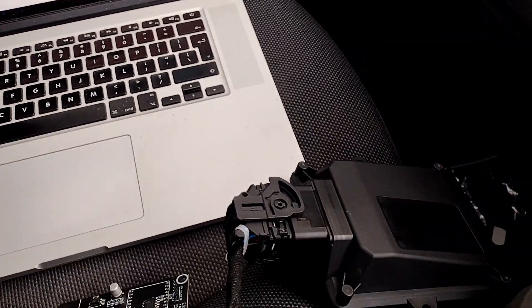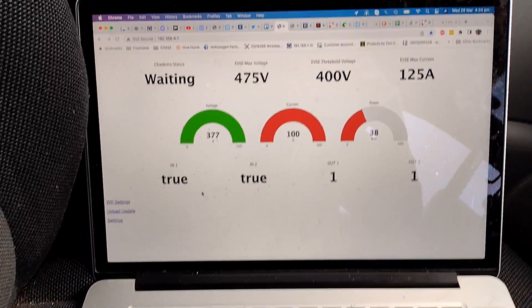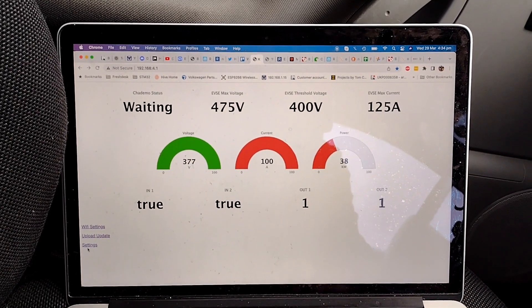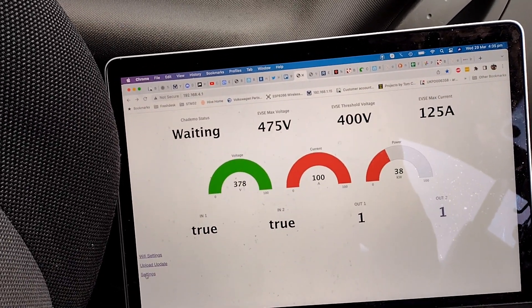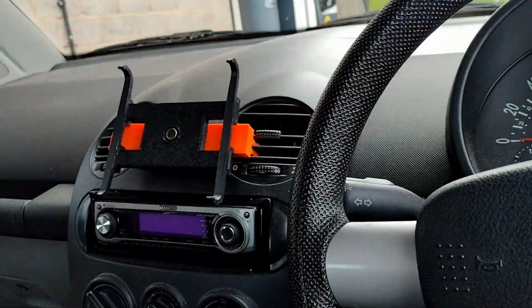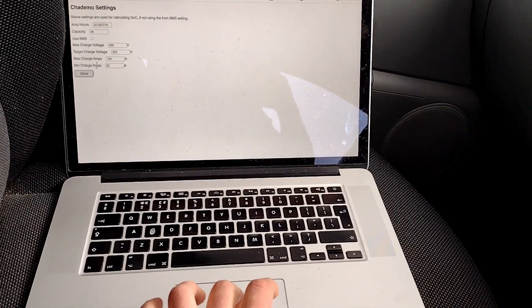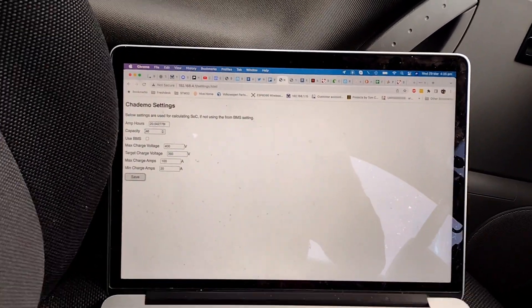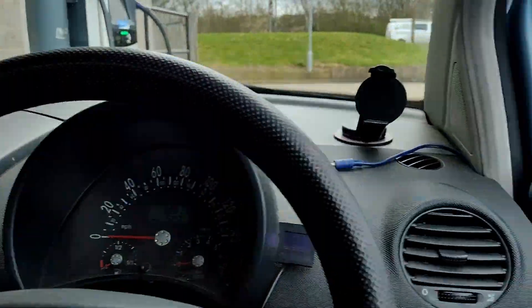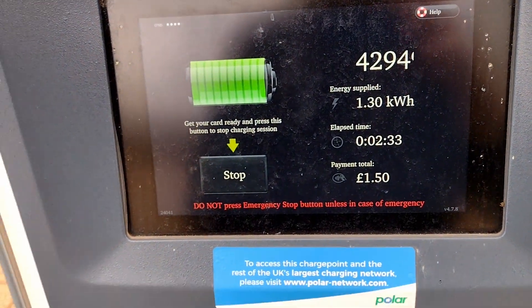Very happy — I'm still charging. Charging — I'm doing 100 amps. I think that might be the max; I've asked for 100 amps as the max I've asked for. Probably want to bump that up a little bit further. I've got a couple of other little things to sort out — as you can see, currently not using the BMS. I haven't got these set to anything specific; I think the problem is they're going to be very wrong on power and capacity, so that's why this is showing a massive state of charge number. But there we go — happy with that.